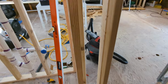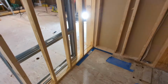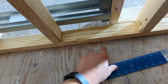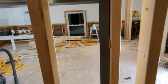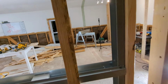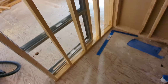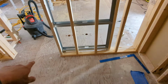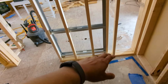And then I'm going to have to get my electrical boxes in here for light switches. What else? I've got my center line of the shower marked right here, and so I centered one of my stud bays right there. I don't know what I'm going to need to do for the shower valve yet, but I try to give myself a nice wide spot there to get all of that plumbing in. So the shower valve will be here and the shower head up here. I think it was about a 13-inch spacing, maybe this whole thing was 52 inches, so almost a 12-inch spacing for these studs.